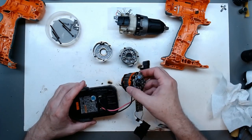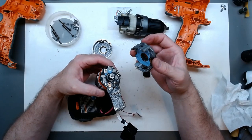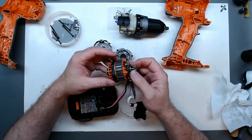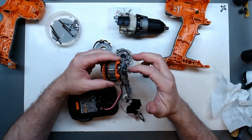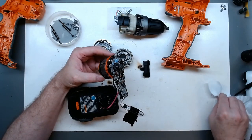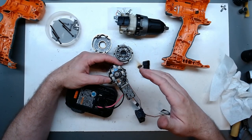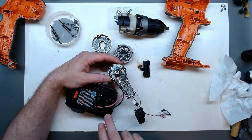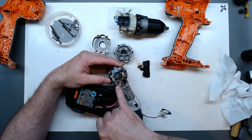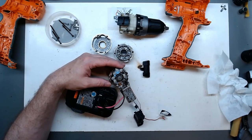So now I just have the battery hooked up, just checking voltages. One thing to keep in mind — I have the end bells of the motor, front and rear. Also the bearings are not supported, so the armature is just against the magnets. You would not want this motor to try to rotate like this. I do want to check my voltage across the board. Our 18 or 20 volts should be coming off the pack, coming straight to the board. It looks like a current feedback — the R001 resistor here — I'm just going to make sure we get voltage all the way through that.